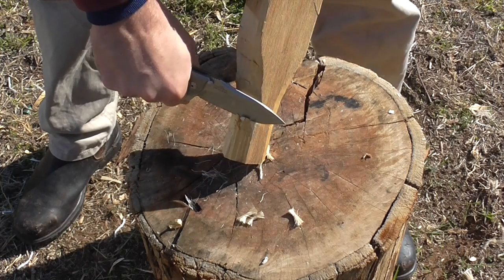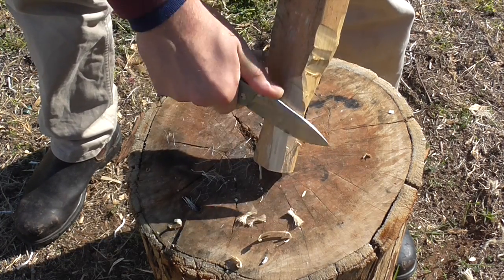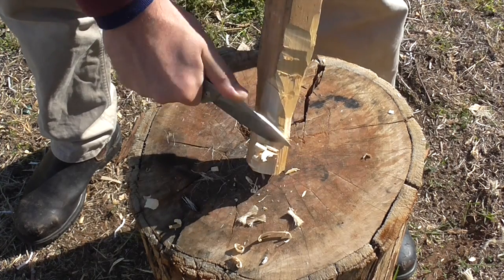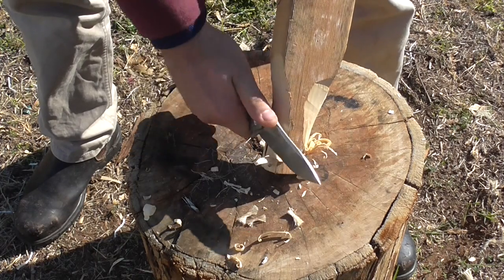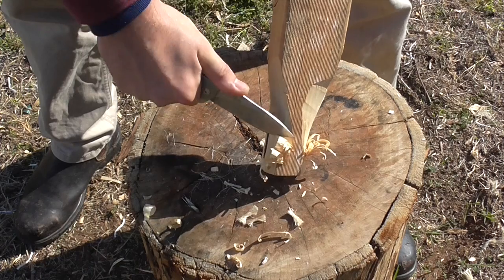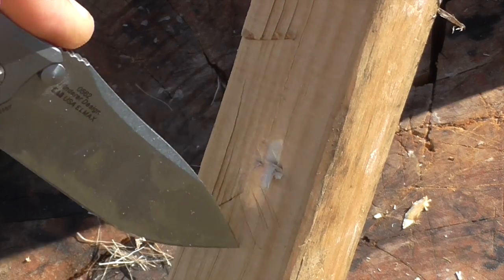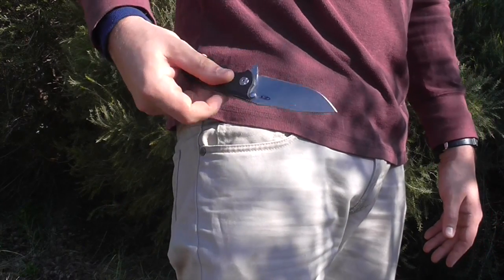To further test the edge and make sure it wasn't too fragile, I did some whittling and twisting cuts in dry hard pine. LMAX was no problem at all. It reminds me a little of CPM-3V in application — a steel that perhaps shouldn't be as versatile as it is, handling high-impact and high-hardness tasks well. Steels like CPM-110V and Maxamet, which might edge it in retention, I've seen chip out in this work. The tip is fine yet strong, able to do fine scratch lines but also dig and pry — a really well-designed tip and blade shape.